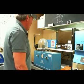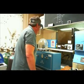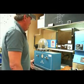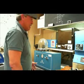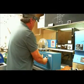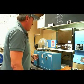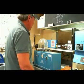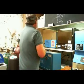Once this goes for about 30 seconds, see it start to bubble. And that's, again, the air coming out of the investment. Release the vacuum. Turn off the pump, the vibrator. Pull the jar off.